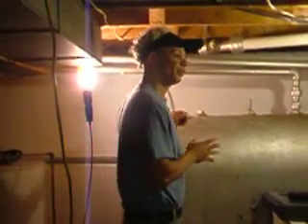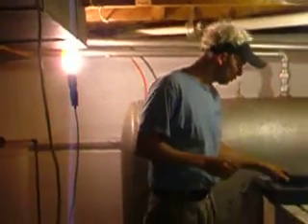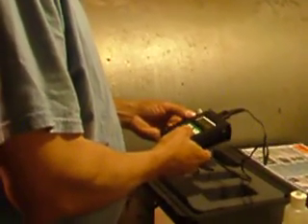What we're going to do is find out the thickness of the tank. You come over here — you're going to see this is what I'm going to use today. We're going to use the TS-4; we call it TS-4 for this type of gadget, ultrasonic. So first of all, we're going to fire it up.